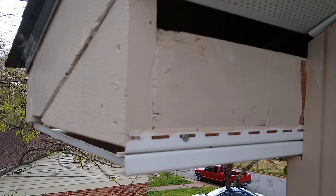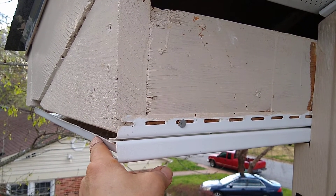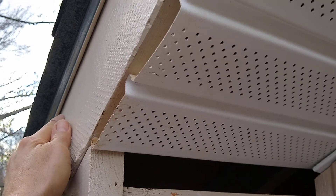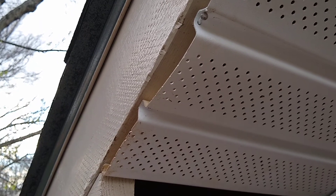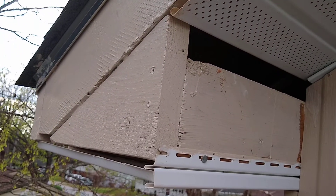You need to make sure you cover this edge, and when your siding comes down it's going to cover this edge too. It's also going to tuck up underneath your drip edge — it has to tuck underneath there a good half an inch or more. I hope that helps.